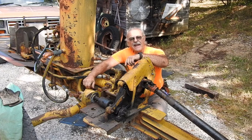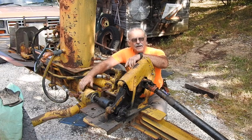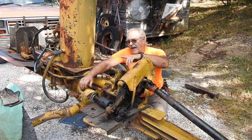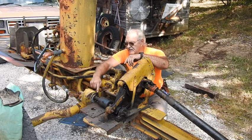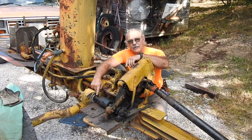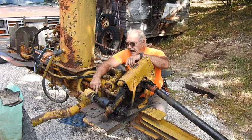I've got some videos back in the past highlighting how my much older brother built this back in 1978, and then I'd done a little finagling and trading — I traded him an Oliver 77 — long story. But anyway, we have had no serious mechanical issues or failures, but I'm facing one right now. What it is, is right here we've got a splined coupling that goes to the splined input shaft on the hydraulic pump. The splines are completely stripped out — the splines inside the coupling are almost completely rounded off of the splined shaft.